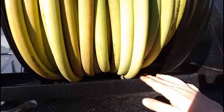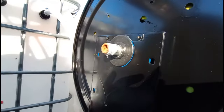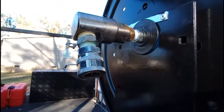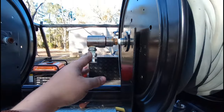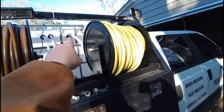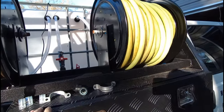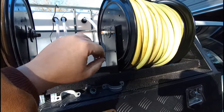So this is water in, and I'm actually not running through the reels. I did that and you can see they get rusted and corroded. Even if you put fancy stainless on there, they eventually corrode. So this one's actually going to come off — I'm going to use this just for storage. Here's my water going in and I have a float valve in there — not a Hudson float, I used a ball valve. It's yellow, almost looks like a toilet float but it's supposed to be higher flow. So there's my water. This is my water hookup — pull off a piece of hose, cam lock it into place, quick and easy. It goes through a filter, goes up and into the tank. And then I have water coming out.